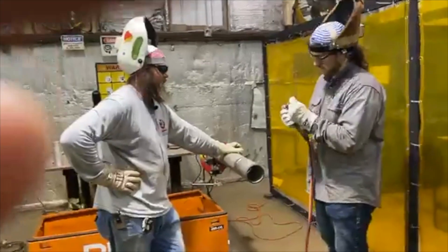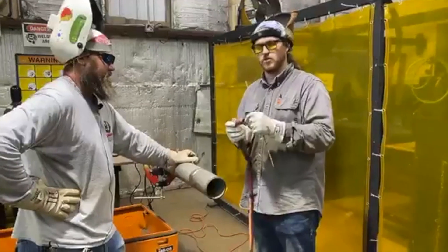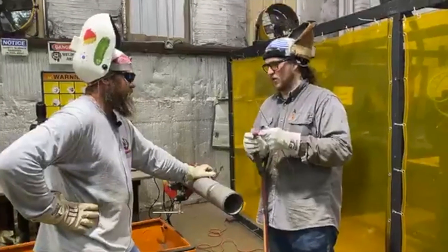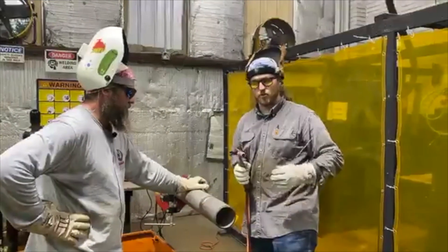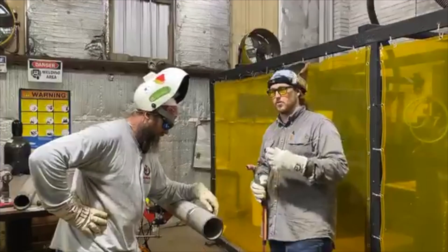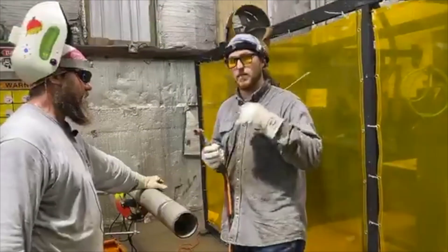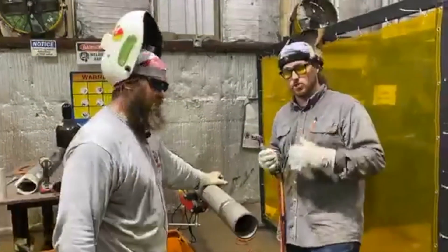So what amps are you running at? I don't have a digital readout, but I'm probably real close to anywhere between 60 and 70 amps. Normally I do a keyhole dip on all my stainless — I feel more secure with it, for me it's a lot easier. But when you're using these flux-coated rods, the keyhole dip method is invalid, you can't use it anymore. The reason why is you have to keep that flux constantly flowing to cover your root on the inside, otherwise it will get sugar.